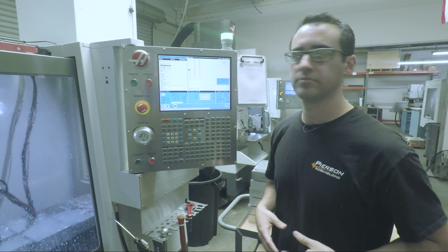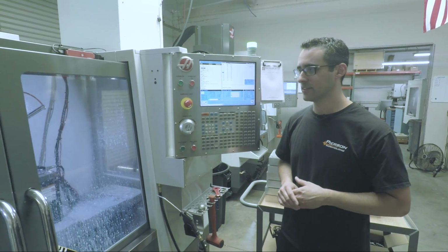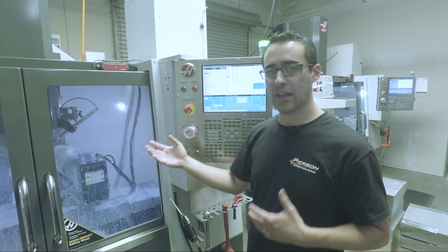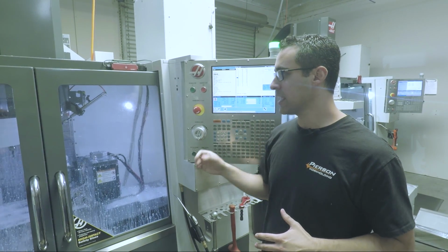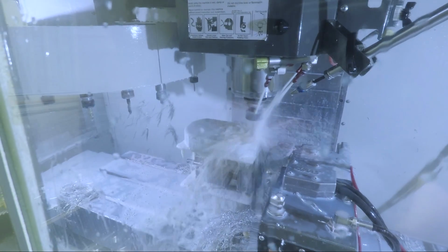Right. So I've got 250 holes in a fixture plate, good reason to use it, and it saves time. Yeah, absolutely. The one thing is the post processor turns on the spindle also when it goes to tap a G84. You can leave the spindle off, just give it the RPM, and the G84 will do it. That's funny. So okay, coming in with a reamer.